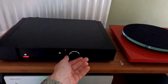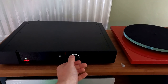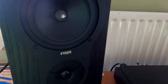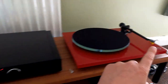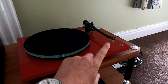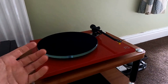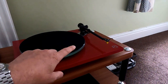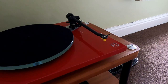It's hardly much lower volume than it was before, actually. So the difference here is that we're getting that sort of noise. It's again a deeper noise from that. The channel that is broken doesn't work. You just get the hum. So if you've got a hum and signal coming through, it isn't a break. But if you get the hum and nothing coming through, it is a break. So that's a way to diagnose that.